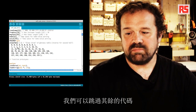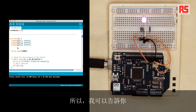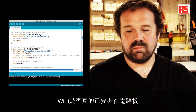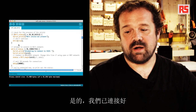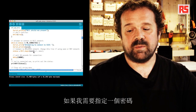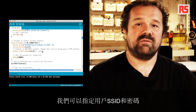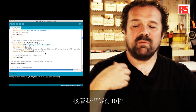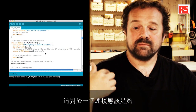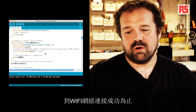I'm going to skip the rest of the code just to show you quickly how easy it is to connect to the Wi-Fi. Here we check if the Wi-Fi shield is actually mounted on the board, then we check if we're connected, and then we simply say WiFi.begin(SSID). If I need to specify a password, after the comment I can put comma, pass, and that will specify the SSID and password. Then we wait for 10 seconds, which should be enough for a connection. This will try and retry to connect to the Wi-Fi network until we're connected.